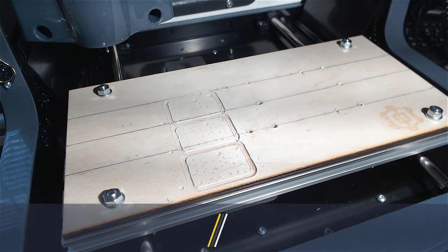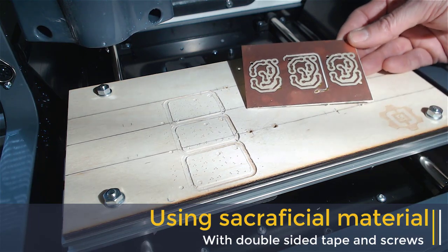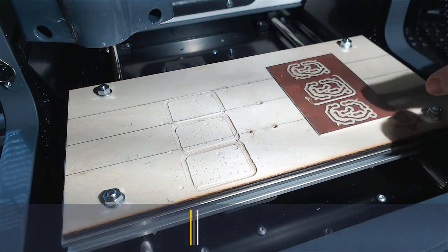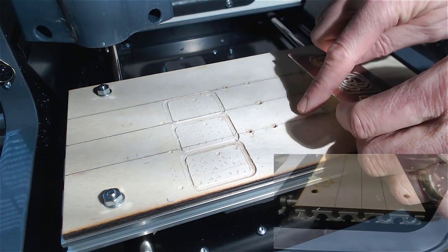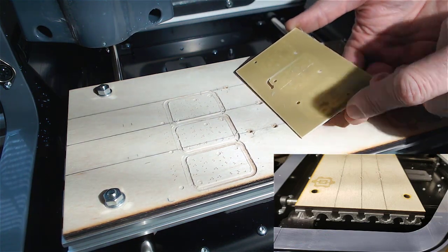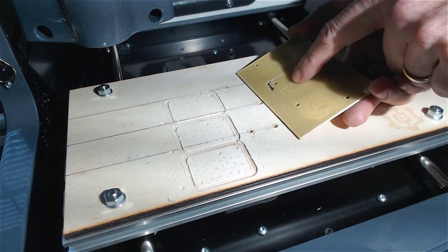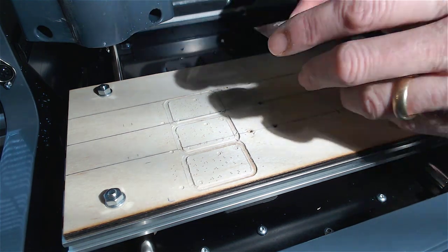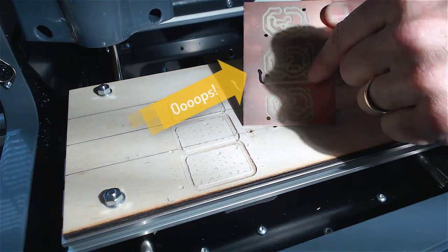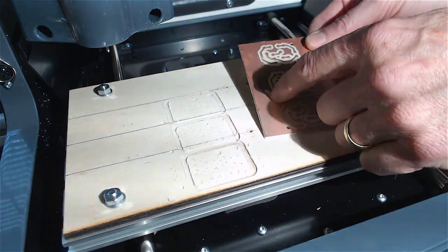The downside with circuit board, if you're taking deep cuts and going really fast, it tends to move around a lot. So what I did was I pre-drilled some holes — notice they're on the lines so that they go through where the slots are in the table. I put double-sided sticky tape on the back, one piece on each of the three sections, so the piece, once it gets cut out, stays attached to the table. This is a scrap now because when I came around with just the double-sided sticky tape and dove through the material, it moved, so I couldn't use it anymore.